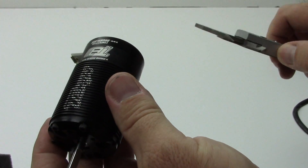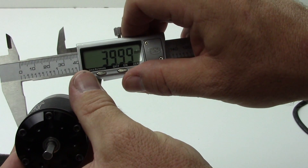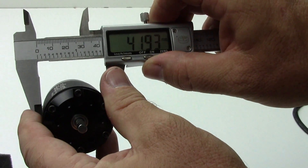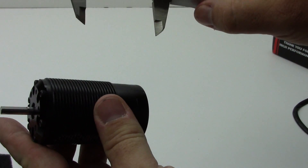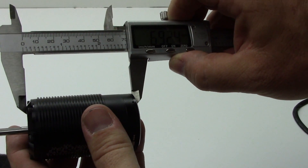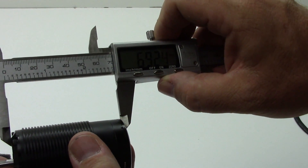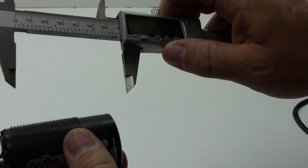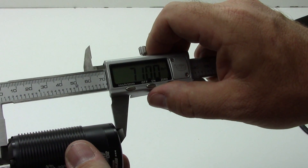As far as sizing, without the fins we are looking at a 40-millimeter design — 39.99 millimeters is what I'm measuring. With the fins, we're looking at 42 millimeters, or 41.94 to be precise. As far as overall length, going from the very front where the motor mount would be all the way to the very back without the sensor wire, we're looking at right about 69.24 millimeters. With the sensor port, you need to add on another couple millimeters — 71 millimeters with that sensor port.